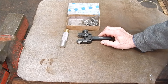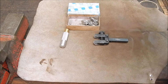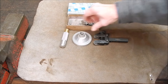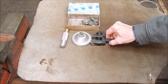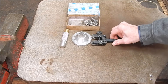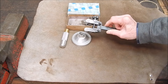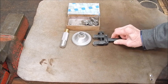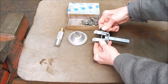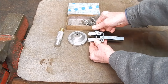I see people doing this all the time. As I said, there are a zillion videos out there on this. But then the question comes: what happens if you've got something that big? It won't fit in — the jaws won't possibly open up enough to do the job, to knurl it. People just don't seem to attempt to knurl it with this type of knurl. But you can, because when it's all boiled down, this is basically a variable version of a plunge knurl.